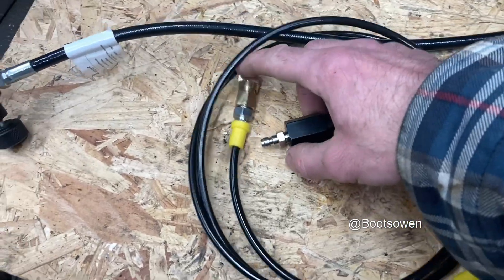I've done a bit more work on it — taken a step from the top down about two mil to the thickness of the root of the thread, because I think that was stopping it. I also trimmed back the hex at the bottom. It's getting more and more modified. I just gave it a spin on the lathe. It's back in again and it'll either work or it won't. Oh — it seems to be working! That's a success. Quite a heavy modification.